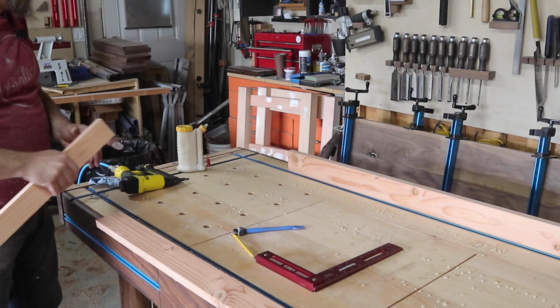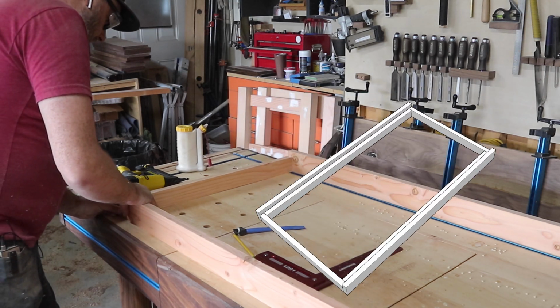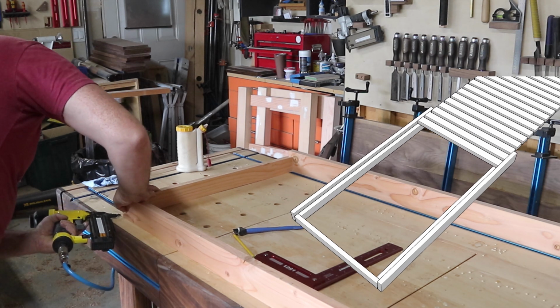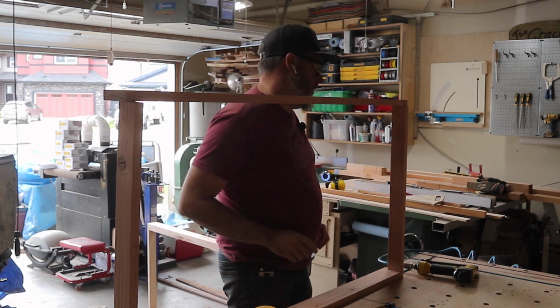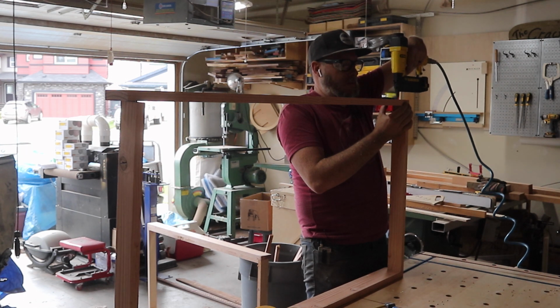With the shelving slats milled up and set aside, I started working on the frames for the lower two shelves. Now the frames have an inner support added on both sides that allow me to have a spot to attach my slats to. A majority of the strength will actually come from the slats, so I just brad nailed and glued these pieces together.